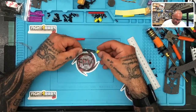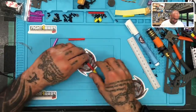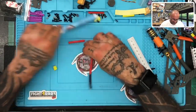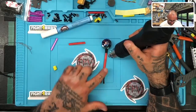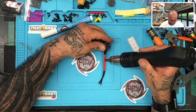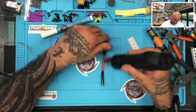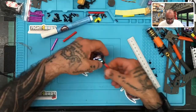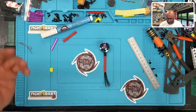Or heat the pad with flux. I use a flux pen. When I go over the pads with a flux pen first, I'm very generous on it. You can get these on our website. We have them made for us, but it's a flux pen like anywhere else. Then I will usually let it dry unless I'm doing a live build where time isn't allowed for that. If the board is still wet when I'm getting ready to solder it, I'll either go over it with the heat gun first, or I will just hit it with the soldering iron to get it a little warmed up. The solder I use also has a core in it, so you get the resin in the core as well, but I always use the pen anyway, and in some cases I'd use the paste, but not right now.